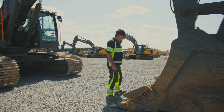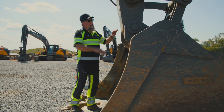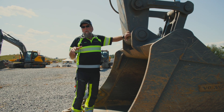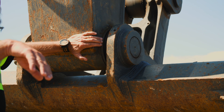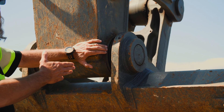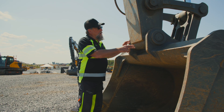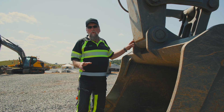One place I'll point out right away is at the end of this boom we have some wear plates here. If you've ever been around an excavator that has a lot of hours on it, the bucket will start moving on that machine, and to rebuild that is really expensive on everyone's machine except ours. You take the bucket off, you replace the wear plates, and it keeps you from line boring and having to redo the machine.